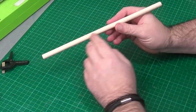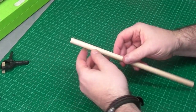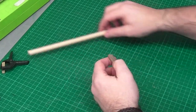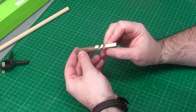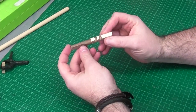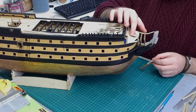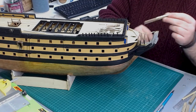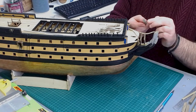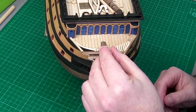This pencil centre line is going to be useful a little bit later on to make sure everything's running nice and true. I'm bringing across the piece I was working on yesterday — the first section of the bowsprit with the gammoning fish cut in. The model's bowsprit has a square section, so we can't put the full dowel in; we just have to take off a little bit either side to make it a flat eight mil so it'll just drop in.